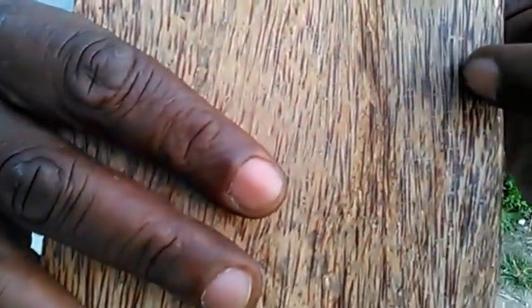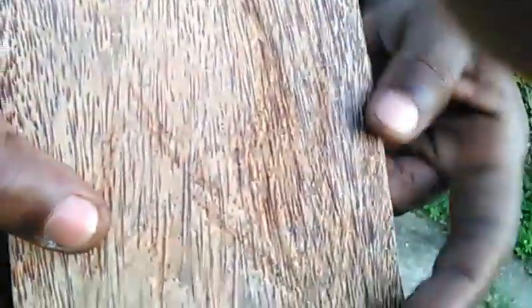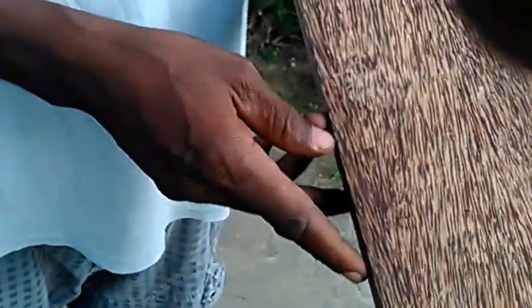If you look right here, you can see this as a demonstration — that's closer to the bark, so you can see how much grain you have right here. As you come further towards the center of the tree, you can see those lines starting to get further from each other. In the parts of the wood where the lines are closer together, you obviously have a stronger section than where the lines are further apart.